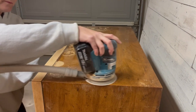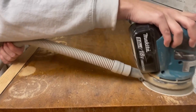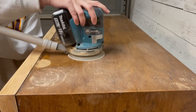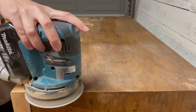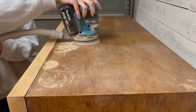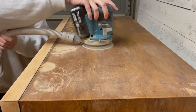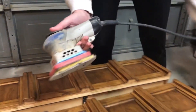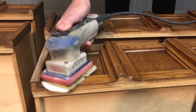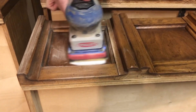The top has a little bit of — I don't want to say it's water damage per se — but it's just some marks from hot mugs or something being left on top of it. It doesn't feel uneven or anything; it just needs a really good scuff sand to make sure everything looks nice and flat when I go ahead and paint. I love my Surf Prep sander and this squishy foam pad abrasive is going to come in handy for all of these details on the drawers. They don't need any fixing — they're in really great shape — but everything is going to have to get a really good scuff sand so that the chalk paint will adhere.